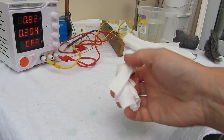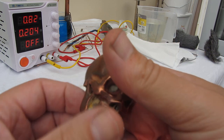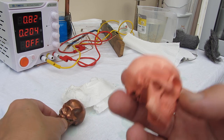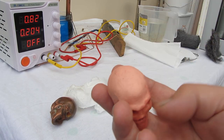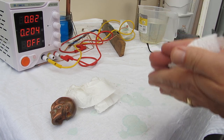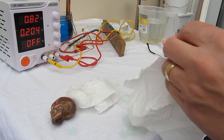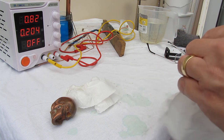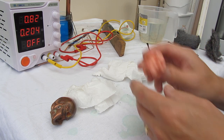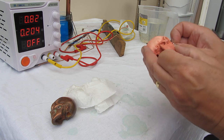At this point I expect to see a nice salmon pink colour. Compare that with an aged copper piece — you can see the difference in colour. Don't be surprised if it comes out salmon pink — that shows there's a nice layer of new copper on there. It'll be dull — that's fine — and in this case a little bit rough. Still a bit damp, so let it dry a bit more and get rid of some of that moisture.